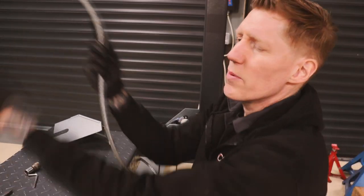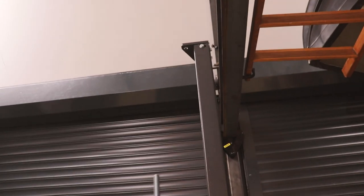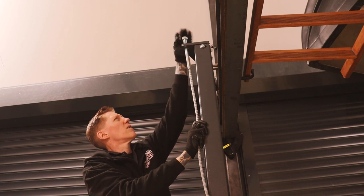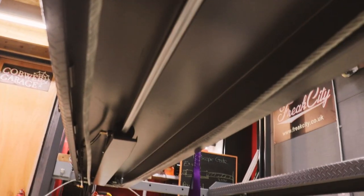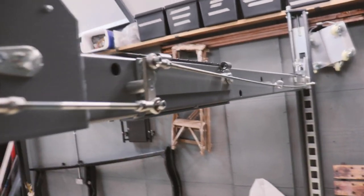It took quite a lot of pulling — the hydraulic arm is extended to its full extent to get the cables long enough. Going up, it clicks into place. Just going around all four posts, pulling the cables up and sticking a nut on. That's under the platform — there are all four cables, one to each post, and that's what pulls to lift the lift.